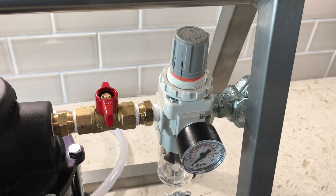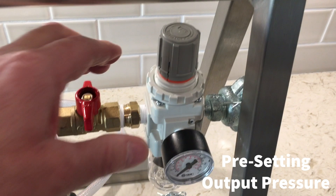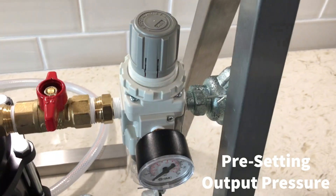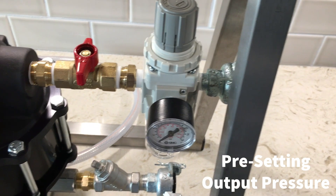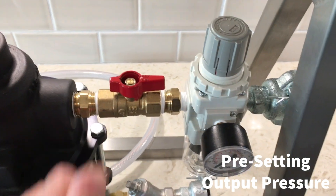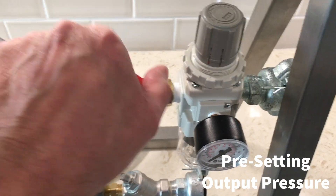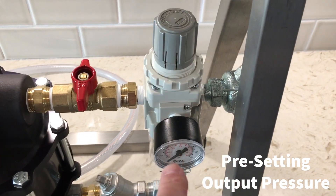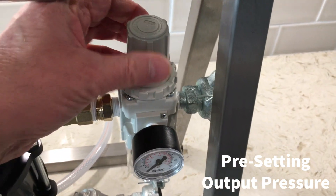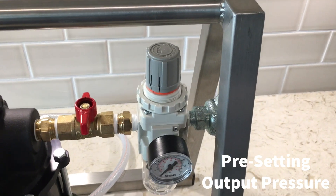If the APU is to be used to test a batch of items at the same pressure, the pressure on the air pressure regulator can be set and locked by pushing the handle down. Each time the unit is operated, the pump will generate the same pressure. The pump can be started and stopped using the pump start/stop valve and the pressure will always go to the preset value. To unlock the air pressure regulator, simply lift up the handle again and then you can adjust the pressure regulator down to zero or to whatever pressure is required for any given test.